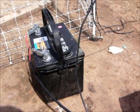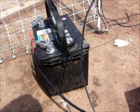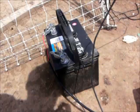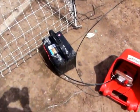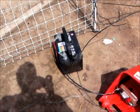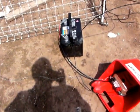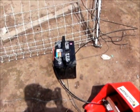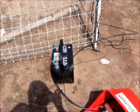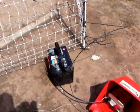You will really feel it, but it's relatively safe — not saying accidents can't happen, particularly when things get stuck in it. I have had chickens get stuck in the fence before that were somewhat the worse for the wear, but they survived. It's actually safer to keep the voltage up because that keeps stuff out of it better and prevents things from getting stuck. As the weeds start growing up into the fence, the voltage will start to drop.